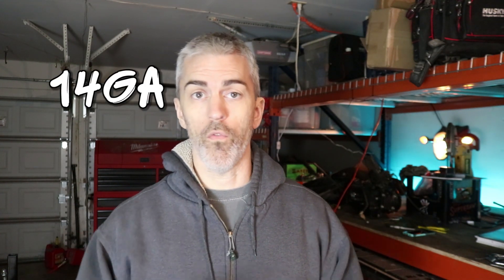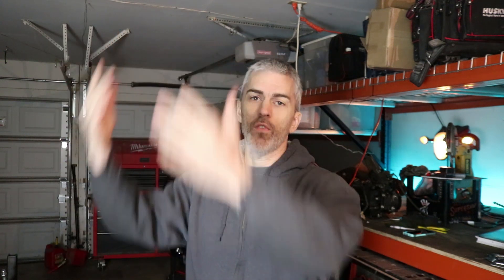On this build I was originally planning on using a one-and-a-half inch round tube with a 14-gauge wall for the backbone. The stock bike uses a single 14-gauge tube to support the entire bike, and I was planning on using multiple tubes. After reading the Chassis Handling and Design book, I was under the impression that 14-gauge would be on the stronger end for motorcycle frames. However, I then looked at the Chopper Builders website and found that he uses 11-gauge tubing for the entire frame — which seemed like overkill, but with a hardtail frame there's no suspension, so the frame takes all the road impact, making 11-gauge appropriate. Plus, this guy has about 30 years of experience, so I'm going to use 11-gauge wall as well, which should set a record as the world's strongest Grom frame.